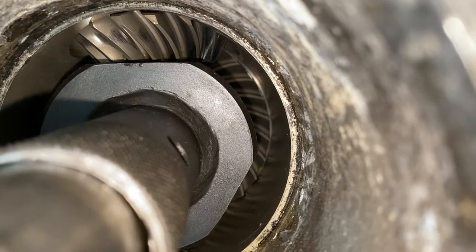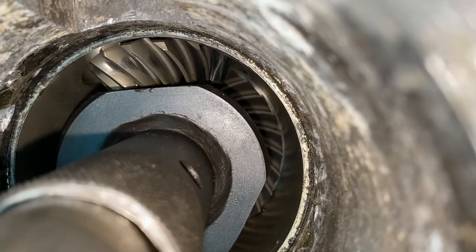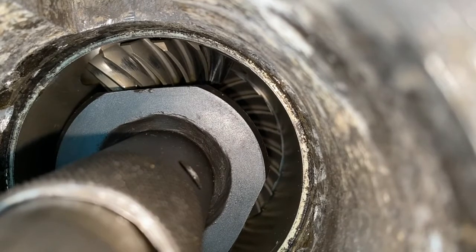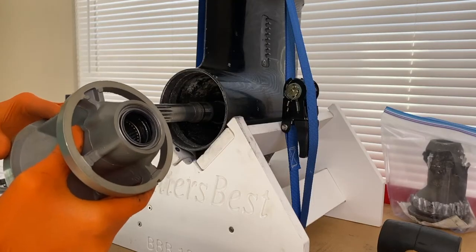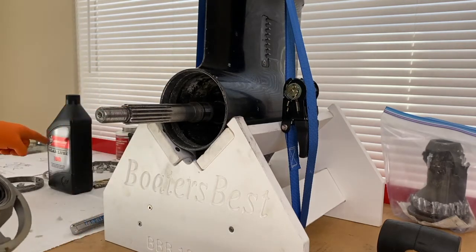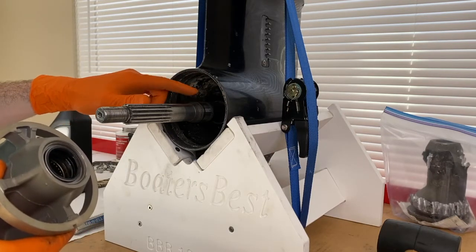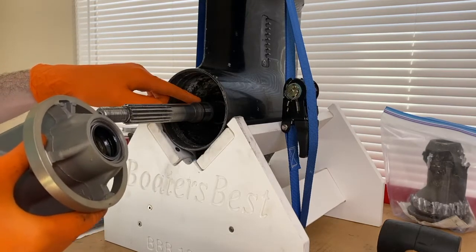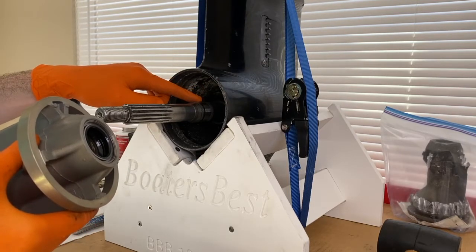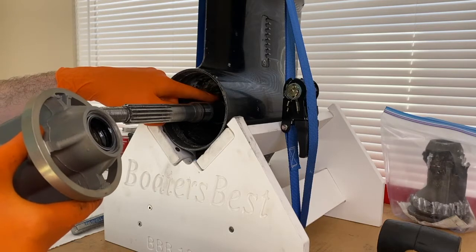Let's go back inside the lower unit. I want to show you the tool in place — you basically can no longer see the pinion gear nut. If I go up top and rotate the drive shaft, it is locked in place. It's important to ever so slightly adjust the drive shaft to align that pinion gear nut in a position where you can efficiently slide that tool in place and lock that nut, gear, and shaft. Next, I grabbed our brand new bearing carrier — I lubricated the internal oil seals with gear lube. The propeller shaft bevels up to a larger diameter, and when the oil seals meet that point you'll have to give it a little friendly force. We're doing this to support and stabilize the propeller shaft and to keep the tool properly aligned and secured to that pinion gear nut.